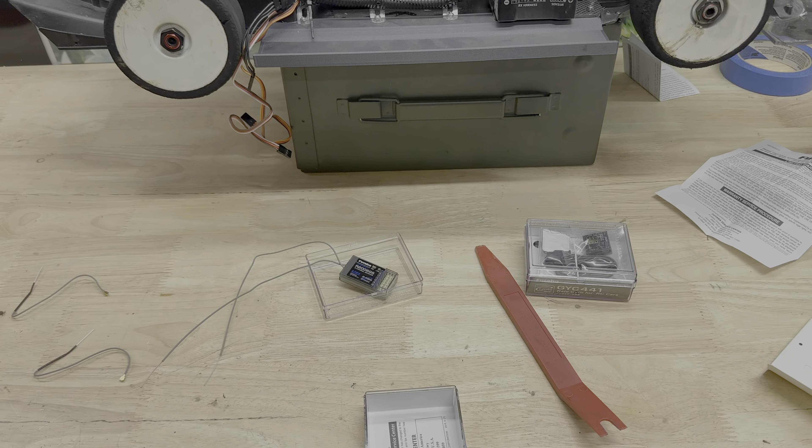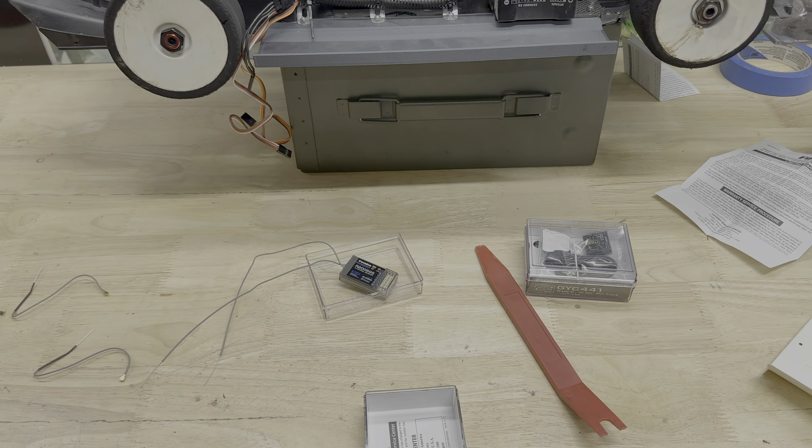They do give us two longer cords here, and I will probably cut these down. This switch on the left controls normal versus reverse gyro — if it seems opposite when you test it on the vehicle, just flip it to reverse. Then there's SR mode for the servo: down is on, up is off. SR mode is a specific setting with the servo itself, and most servos most people use don't have SR mode, so I'm going to leave that off.